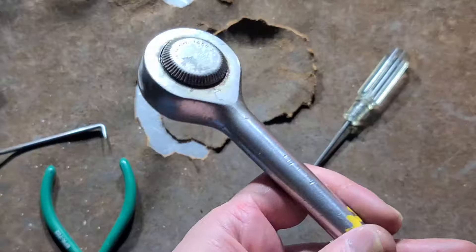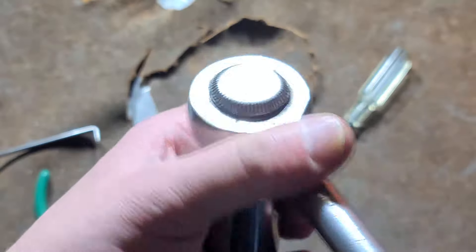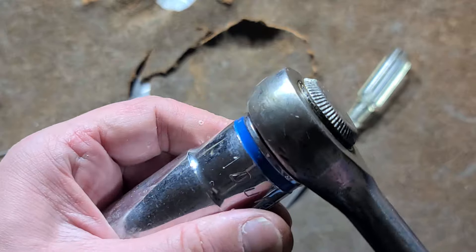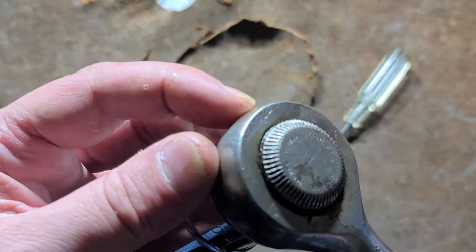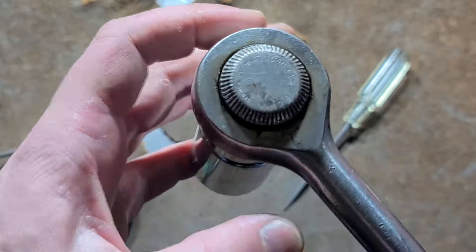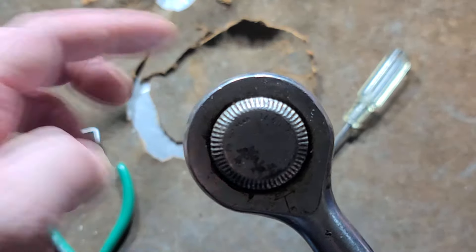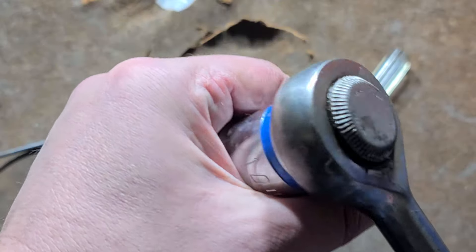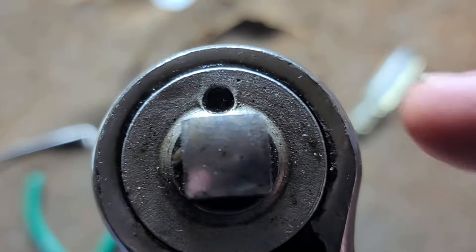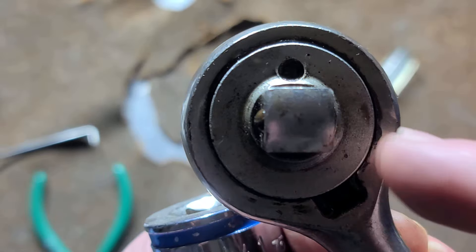Let me put this back together. Just a little lube — still not a great half-inch ratchet. A round head ratchet, even for the 1960s — New Britain's were awesome compared to this. Many brands had at least three teeth on the pawl. Many Williams and Bonney's and so many other brands would actually use two rocking pawls with multiple teeth on each pawl. On a ratchet like this, it's not going to be the anvil that fails when you put way too much load — it's the shearing force against the center pin. You can see that center pin is way smaller than the half-inch anvil.